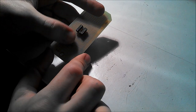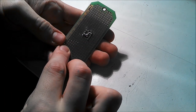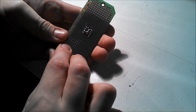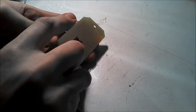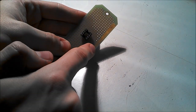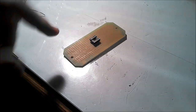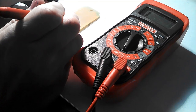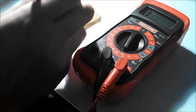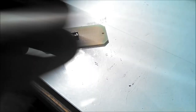The next step is to solder together pins one and six of the IC socket. On the back you can see I've connected the pins by soldering the pads together on the board. If the notch is at the top, the pins are numbered one through eight. To test that the pins are connected, get a multimeter, turn it to continuity, stick one probe in pin one and one probe in pin six — you should hear a beeping sound, which means you've done that step correctly.